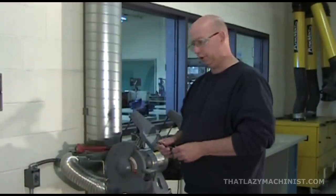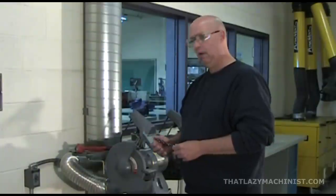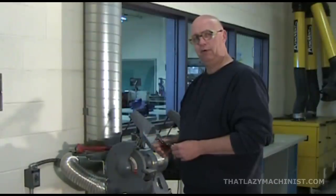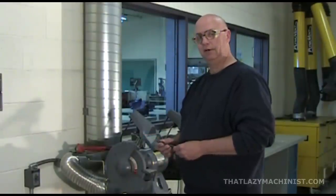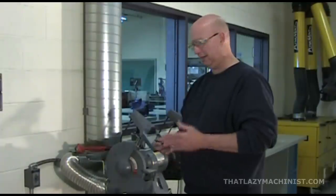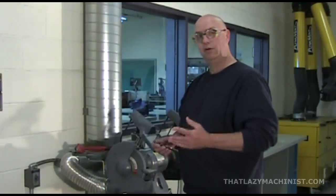So a good suggestion would be to complete one side first. Do one side, grind it down a little further than required, then turn the drill over and do the other side, and bring it slowly back to center. Avoid the flip-flopping. It makes things complex and makes it a little more difficult to get our 59 degrees. So let's do it.